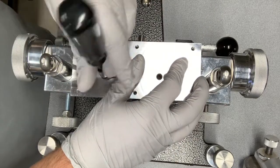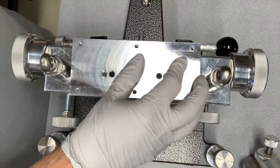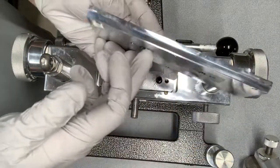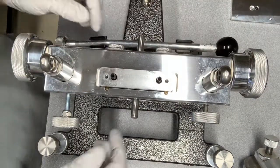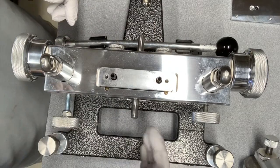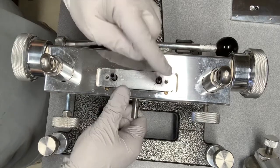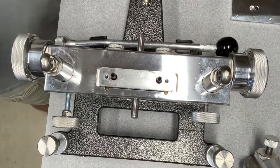Use the right size bit so that you get really positive engagement on the screw head and get those out. I've done it a couple times so mine are a little looser, but they did take a little pop the first time. The plate just comes off and goes to the side. Here's what you're left with: the springs and the two mounting screws. From whichever side you've been shooting on, lift the joystick up — that gives you more spring available and makes mounting easier.